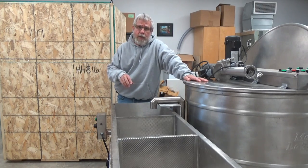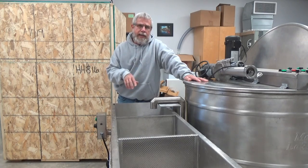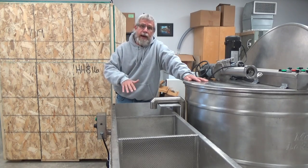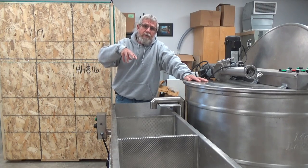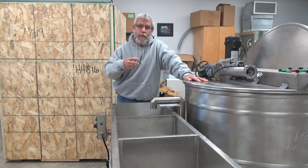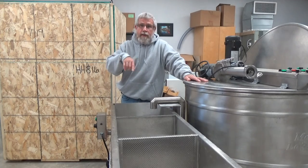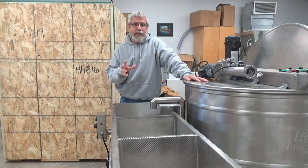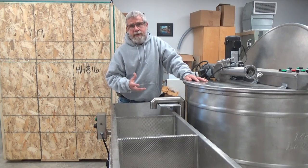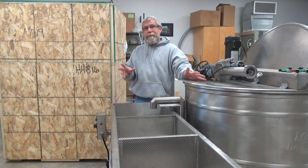That's where this little barrel — the honey wax separator — comes into play. We'll grab the drums using our drum lifter, which can lift up to 800 pounds. When you get a 55 gallon drum of honey you're close to 600 pounds. We'll tilt and drain the honey into our bottler. Then once that level drops, we'll take all the honey and cappings and throw it into our honey wax separator. It will spin that honey-wax mixture, separating the honey and the wax. So I bypass the clarifier, allow natural filtration, and when the honey and wax mixture starts coming out, I'll throw it through here. That's basically the process I'll be using.